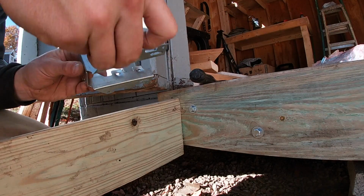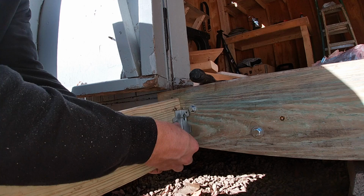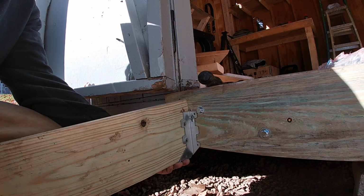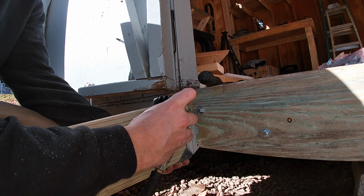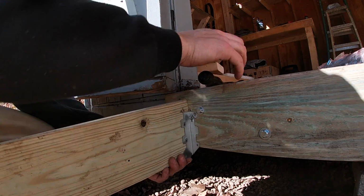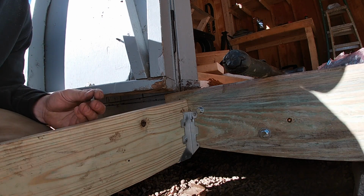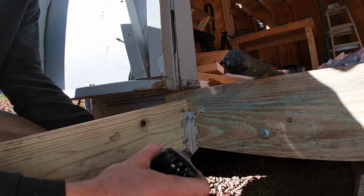So with this, you slide this plate up and you slide your joist hanger up, wow. And then you put here, and that'll zip right in. Then you can bang down these nailing flanges, and then you can continue to just put in screws, excuse me, nails.